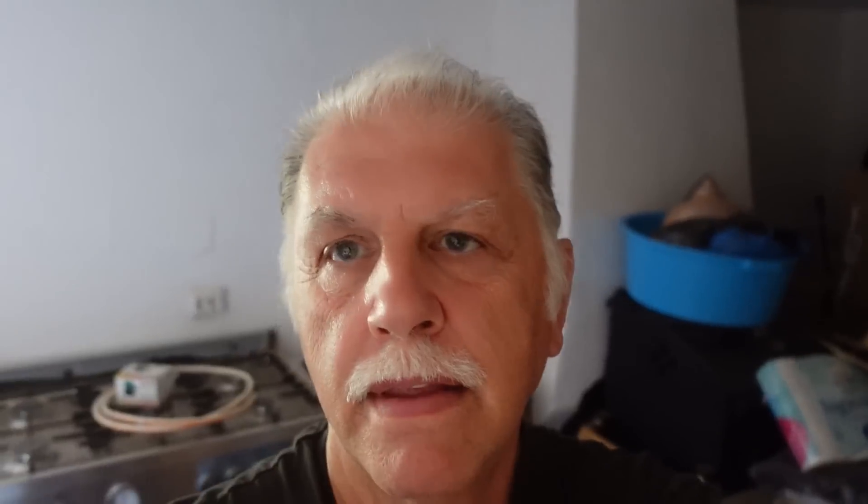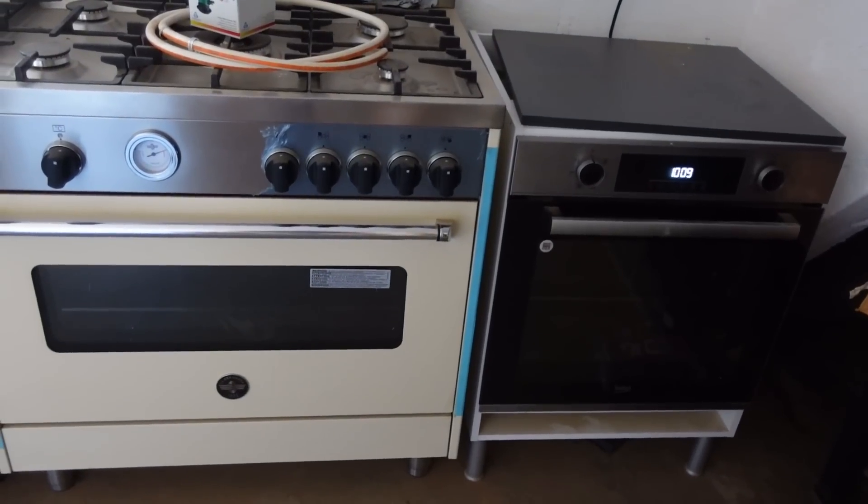This morning I'm going to make an attempt at fitting Debbie's cooker - that's the big one behind me. We've got a gas bottle and we've already got electric down to it, but it all needs connecting. The gas bottle needs connecting too, and obviously we've got to pressure test it as we go. We're having to do a bit of a voiceover on this video because the builders are making such a noise.